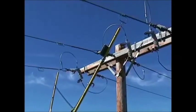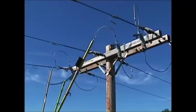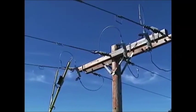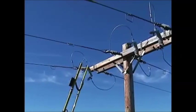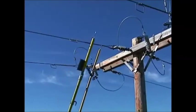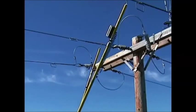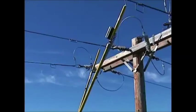Road to field, I'm seeing 12.4, which is phase-to-phase voltage, so that's showing good. Just for extra security, let's go to a non-metered end to that center phase out on the top, and I'll go to the field phase. I'm seeing 12.5, so that's a phase-to-phase voltage.